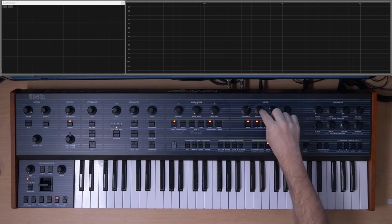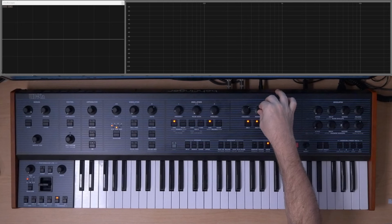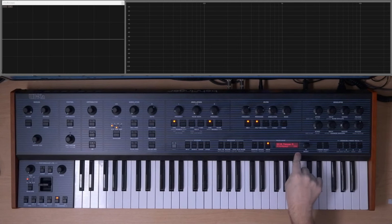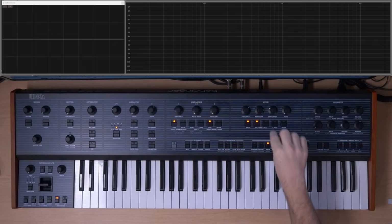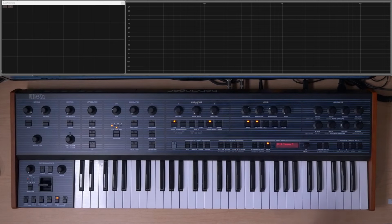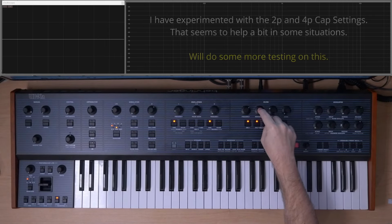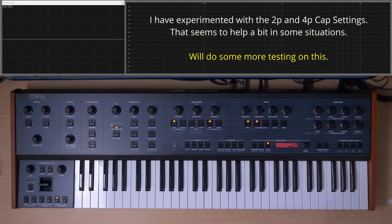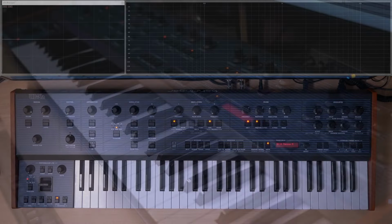I found it's pretty hard to dial in, and I'm often tweaking the resonance control by the very slightest movement, where I'm literally just moving back and forth one digit of change for the resonance, and feeling like I'd like more resolution in there, like I'd want to get it in between there sort of. And I don't know if that's something to do with just how they're translating the voltage of the potentiometer for the resonance control here to the actual resonance control on the filter circuitry.